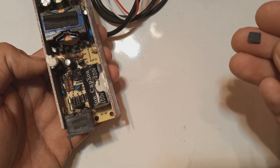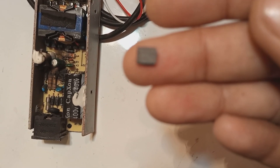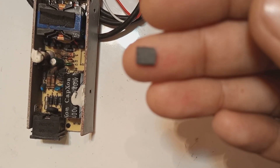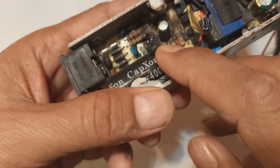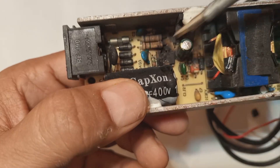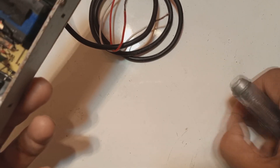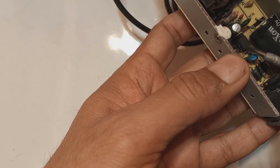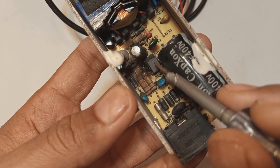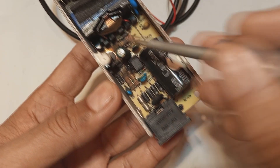Inside you can see this power supply. This is a standard power supply and here is a part which has fallen from it. This part has the number 38 written on it — KA38 or UC38 — which is UC3842 or UC3843. These are standard ICs used for these power supplies, commonly used in Chinese power supplies. This IC had been broken from the inside — the top had been broken, it exploded, and the whole thing had been blown.